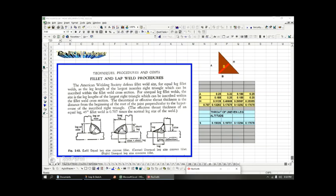He did a convex weld, and he's going to come up to the engineer and say, "Hey, Mr. Engineer, look at this. I did a convex weld just like you told me to do, but it just slumped a little bit. It's not a big deal because the throat is still the same as your perfect weld over here," but he's wasting weld material right here. So he's not very efficient, okay? That's on the long leg right here. And here's the short leg.